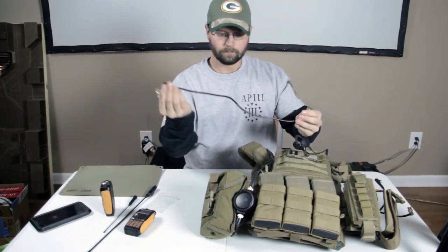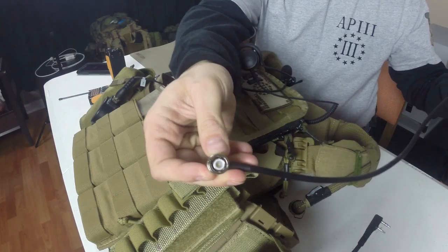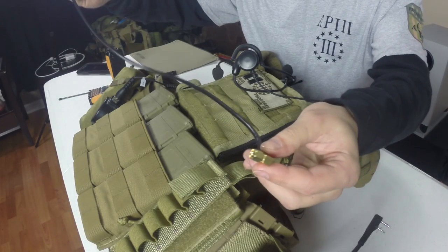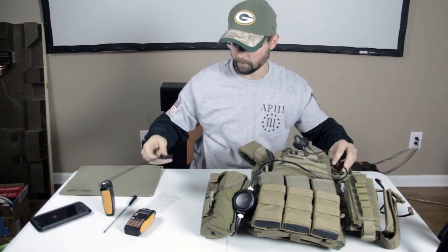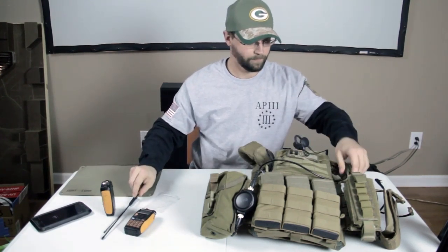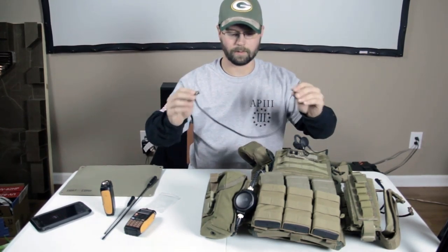This cable is the BNC female side, as you can see here, and that attaches directly onto the adapter I have on the radio. The other end of the cable is SMA. I did that because it's smaller, more compact, and I simply have another one of these antennas, a 771, that's the SMA on the bottom as opposed to the BNC. This cable is, I believe, a 20-inch long cable, which is plenty long. I had some extra left over and wove that in to take up the space.